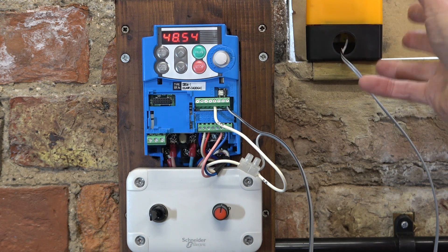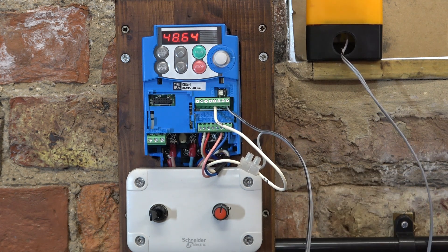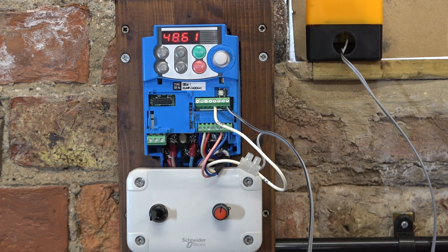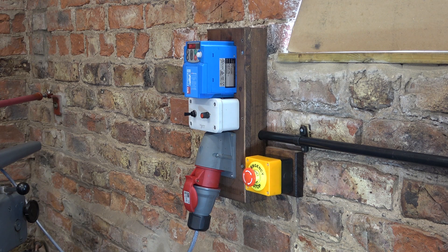You might say that's a bit dodgy — you really don't want it to work like that — but it means I can connect the emergency stop to a foot pedal for my welding positioner. When I want the positioner to move I just depress the pedal, and when I want it to stop I let the pedal go. I've got at least two motors to drive with this inverter — they're only occasional-use motors, so when I switch motors over I'm going to have to change the settings on the inverter, but it's better than buying two inverters and it's not very often anyway. This inverter is rated for three-quarters of a kilowatt, or one horsepower. I hope that's useful to you — thank you for watching Haxby Shed.